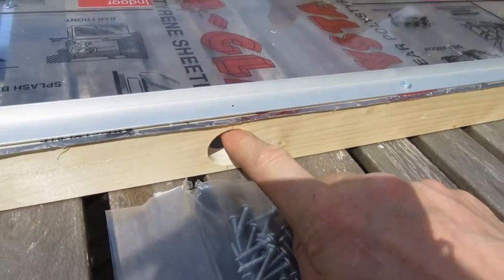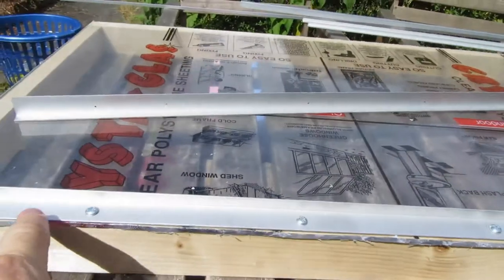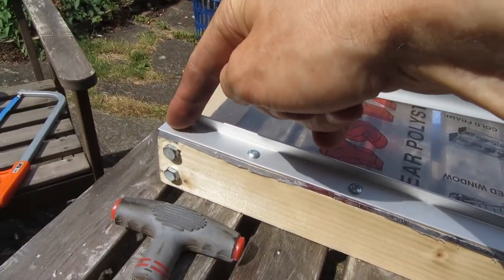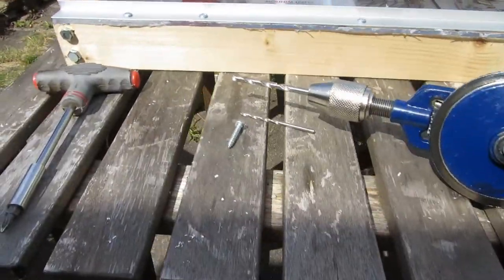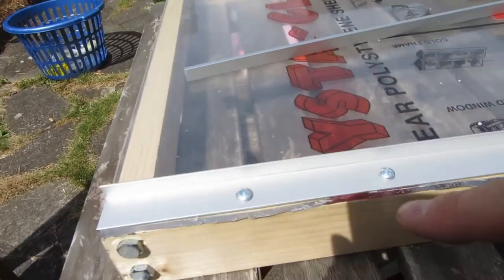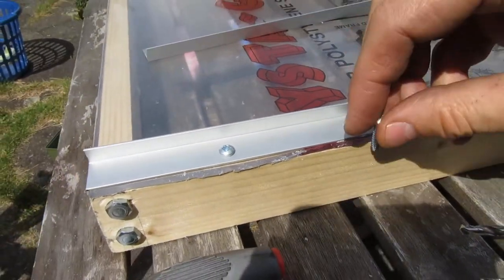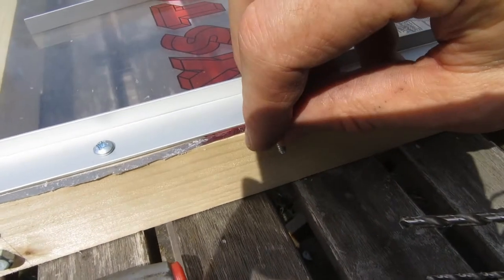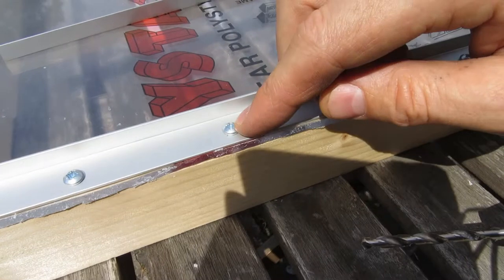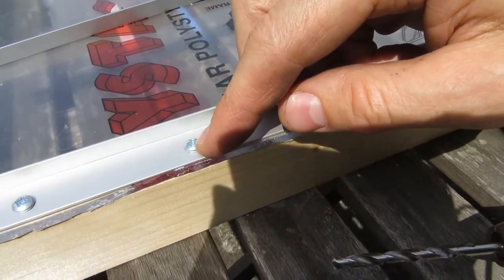I've skipped one here because of the holes, so I'll probably end up doing the half ones here. You can see I've done the half ones to get close, but I'm not going to send a screw down there. Something quite important to note is that the aluminium would be quite tolerant, however the perspex would not be tolerant of a tight hole. I need a tight hole for the screw to go into the wood, a loose hole for the perspex, and for convenience I've done a loose hole for the aluminium as well.